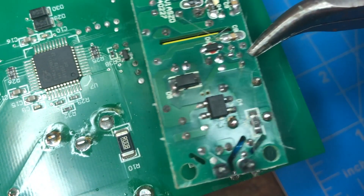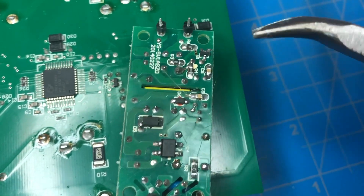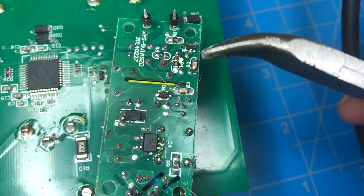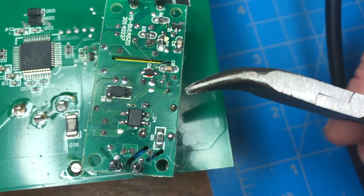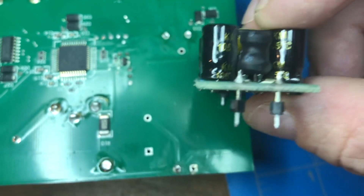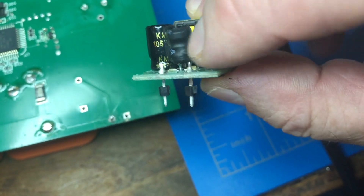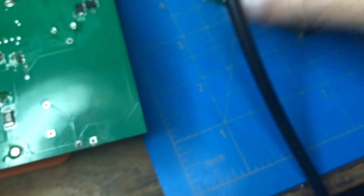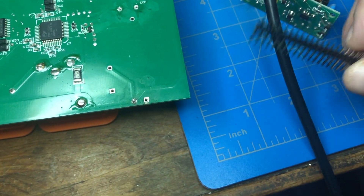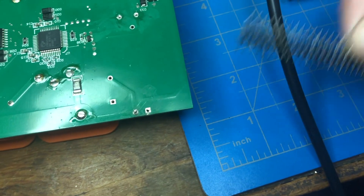I did get it out of there. Taking a look at this board, it doesn't appear to have that same problem with that little capacitor — it's possible I might have crushed it while using pliers to get it out. Anyway, here's the board. I just need to clean up these holes a little bit because I'm going to need to stick the new one's pins through there. Now we've got to solder some pins onto the new board. If you don't have pins, you might have to desolder these to use on the other board. Luckily I have a whole kit of pins so I don't need to do that.